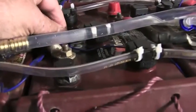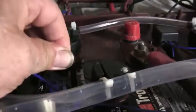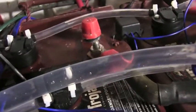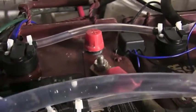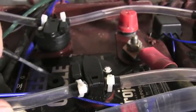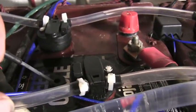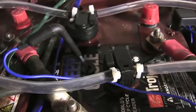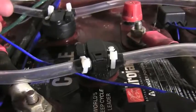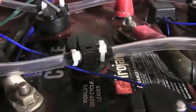What's really neat is this probe thing. This probe sits in your batteries — it sits a quarter inch above your plates. What you do is take a half inch drill and drill a hole into your battery right here. Then you get this plug that you put into that hole, and this probe just fits right down inside. The probe comes longer — you have to cut off what length you want. Make sure you're a quarter inch above the plates in there. So you stick this in right now — the light should be red, and right now it is red, telling me my batteries are low.